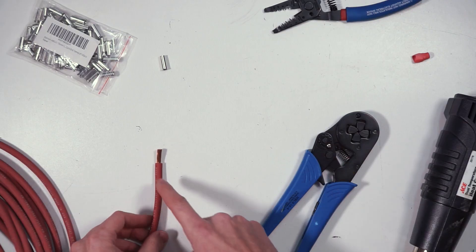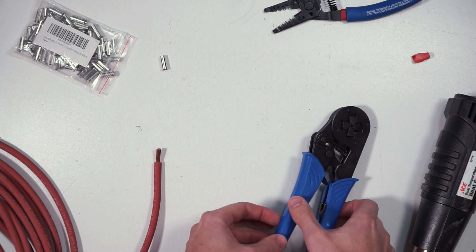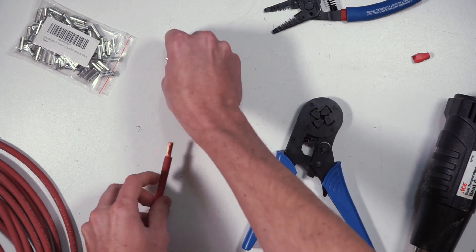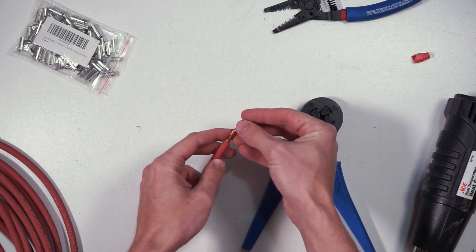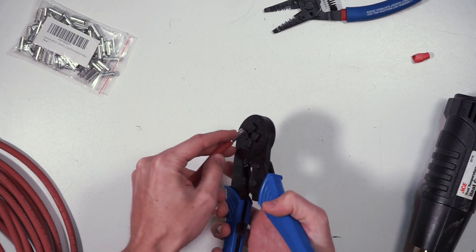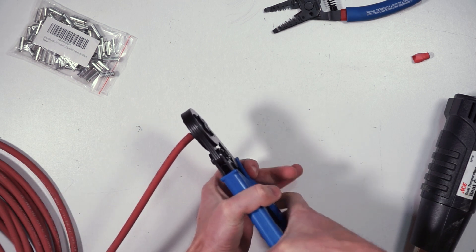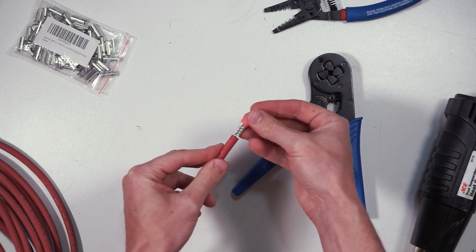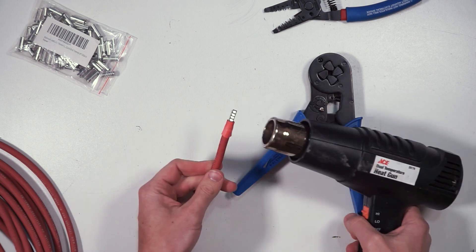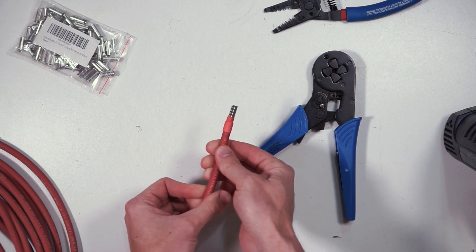Installing these ferrules is absurdly easy and takes just a few seconds. This is a 6 gauge wire and this is a 6 gauge ferrule. This is a ferrule crimper capable of crimping wires from 6 to 12 gauge. To install this we just take a wire with the insulation stripped back the length of the ferrule and insert it into the ferrule, making sure that all the wire strands are contained inside the tube. Place the ferrule into the crimper and squeeze it until it releases. From there get a small piece of heat shrink and put it on the ferrule just to cover up the gap and just a little bit of the ferrule end and the wire insulation. This will just give the ferrule a bit more support and clean up the look even further.